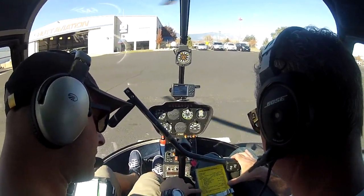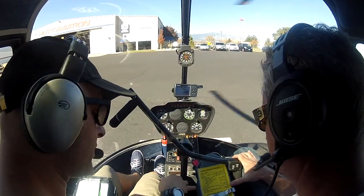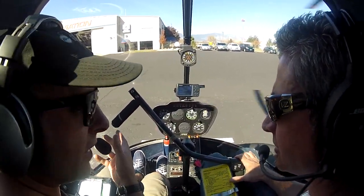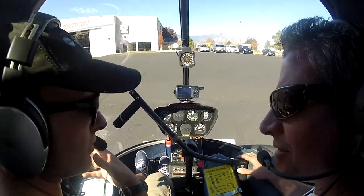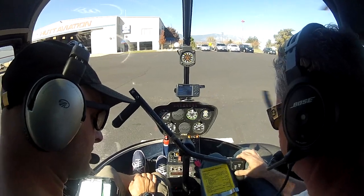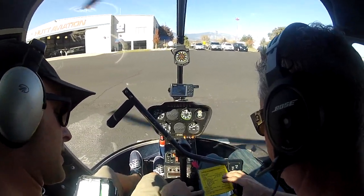So, got our headsets on. We already checked for unusual noise. That unusual noise, what you're listening for, is just a bad bearing. I don't know if you've ever heard of a bad bearing before. Not really. It's kind of like a whine. Some people compare it to a siren. Oh, yeah. High-pitched squeal. Yeah. You'll know it when you hear it. Okay, got our headsets on.